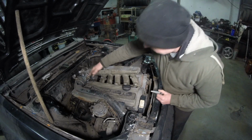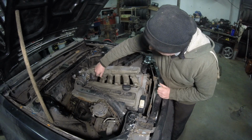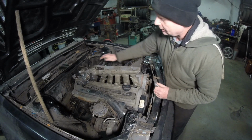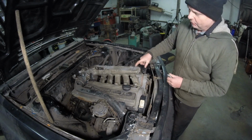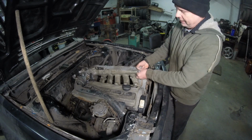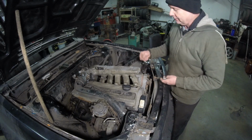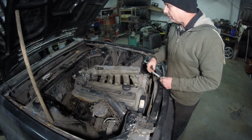And it gives me a much better indication. Because if you look right here, I'm going to go like this all the way around and back down and have the plate like there. So when the air comes in, it hits that plate and goes into the port instead of coagulating like this right here. The only thing I could think of they put this in here is because of a backfire or something, to create an air pocket in here. This thing might even, it's not solid. It's probably this thick, but they have a cast plug here, so we might as well just get rid of it, because it's useless. All right, let me throw this in the vise.